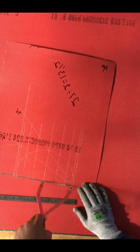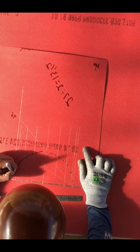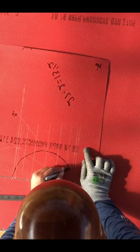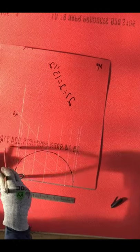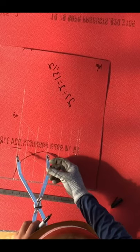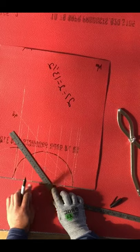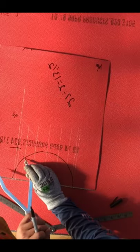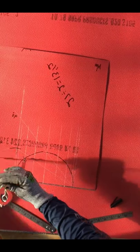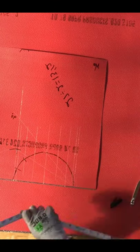With my dividing circumference ruler, I make half a circle. After I make half a circle, I want to divide that quarter of a circle into four parts. So we found the center and we just mark our line like we normally do when we're gonna make a T or an equal T. When you divide the quadrant, keep in mind that a quadrant is a quarter of a circle, and we divide that in four parts.